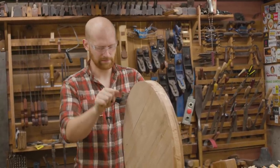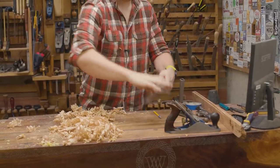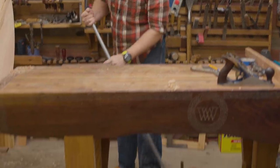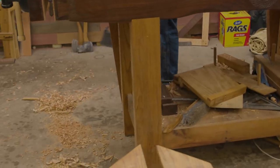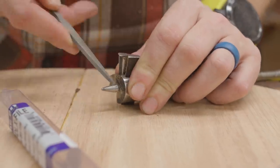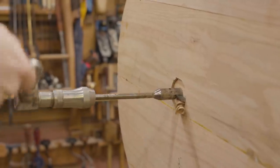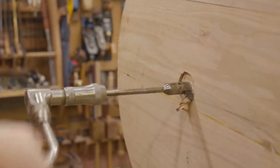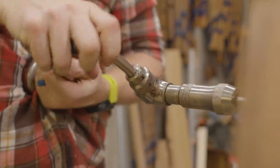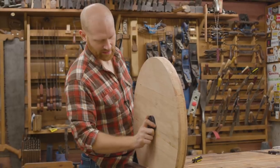After hitting it with the spoke shave, we're ready to start working on putting the center in. I found a hub piece with a three-quarter-inch hole that matches up with the frame, and the outside diameter is larger, so I can use an adjustable auger to match the size it needs to be. I used a ratcheting brace so I can get more pressure on the downstroke than the upstroke, ratcheting where I have more strength and occasionally going all the way around.